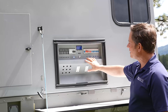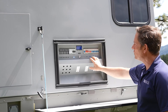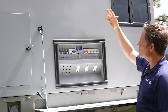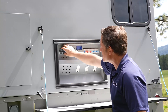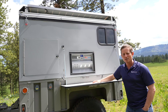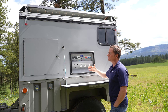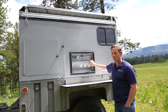The power panel is simple — expose it and hit the power button. You can scroll through and see the inverter performance and how many watts are coming in off the solar panels. Right now with our two panels we're generating 645 watts. This controls our AC side; the DC side is the master on/off for the solar panels — the ones above plus any additional ones. Then we control our 120 volts, our 240, and our accessories, which include the outlets, our water maker.